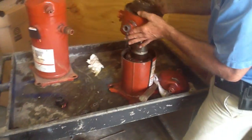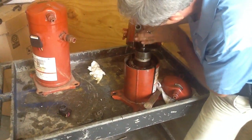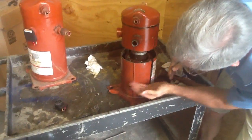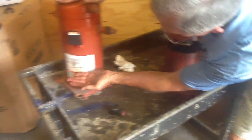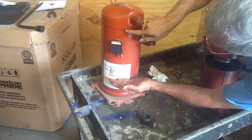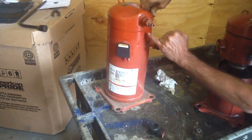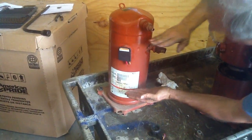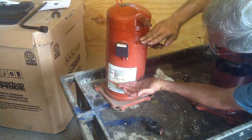Let me go a little further here and set this back on real fast. The oil level is about right here. The suction side of this whole compressor is right here — see where this cap is? See how you've got a welded bead right here? This here is the high pressure side of the compressor. This is the suction side of the compressor. See how the suction line is right here?